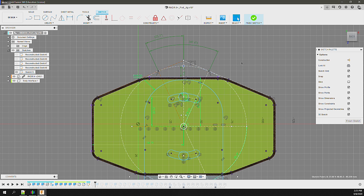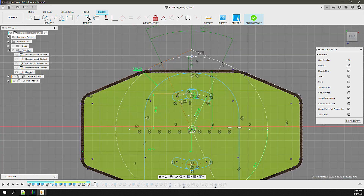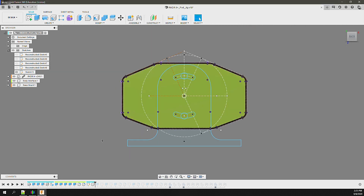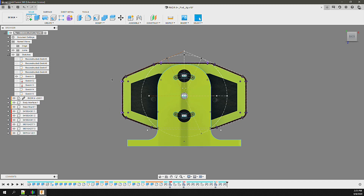I added points where the planes were tangent to the ellipse — these represent the work coordinate system zero for the body when it's rotated, which will be used when generating the milling operations. They're really all the same point at different degrees of rotation along the ellipse. When using the jig, I'll set the WCS zero in the centered position, and all other off-axis angles will share that exact same WCS zero. The only challenge is that the center WCS is floating in midair — in this case 9.5 millimeters off the top of the body.